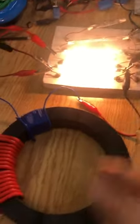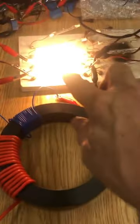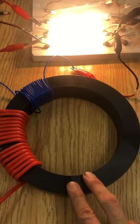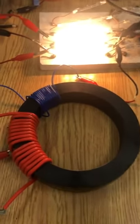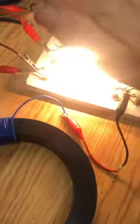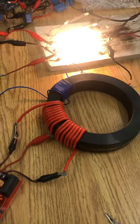These are special cores. This is a 100-watt, I have a thousand-watt, I have twenty-five hundred watts. We can put five thousand watts on the primary and have 50 kilowatts come out, because this core is rated for 1.6 Tesla — that's 160,000 watts. 160 kilowatts can come out of this core material before it's saturated. These are the highest technology on the planet for core material. Good and bright — if you need heat, there's a hell of a heater, winter's coming. These will be twenty-five hundred dollars a machine because of the core material, my time, and my technology. Have a great day.